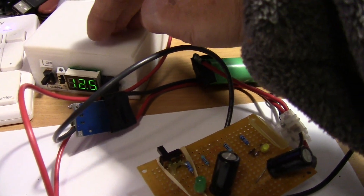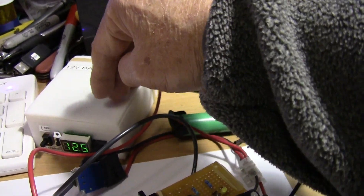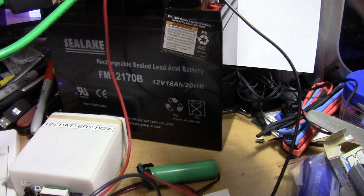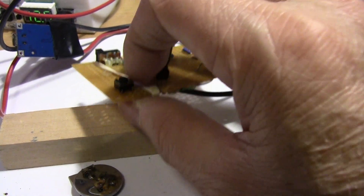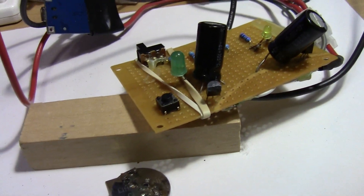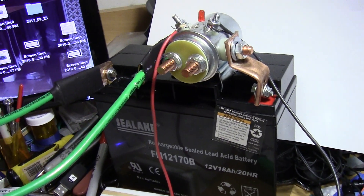For the coil part, I'm using a 12-volt battery box instead of the main battery, because when I get the timer I want it to be separately powered so I don't risk shorting out the electronics in the timer. This momentary switch is just a small one for testing. When the timer comes, I'll try again and see if it gives me better control and a better weld. Thanks for watching.